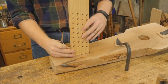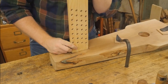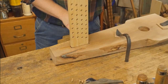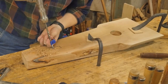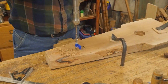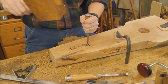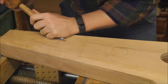The last thing I need to do to the chop before finish work is put in the spacer bar — the bar that will keep the bottom of the leg out away from the chop. All these pins allow me to put a separator in there to hold it against the leg of the bench. I clamped it in place, drew on it with a Sharpie, then came in with a marking knife and marked out precisely the shape. Much like I did with the bow ties, I can use the auger to take out the majority of the waste, then come in with chisels and clean out the rest, giving it a very tight fit to keep the spreader bar into the bottom of the leg.